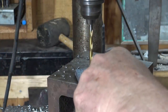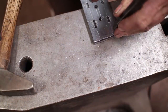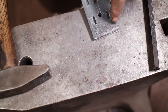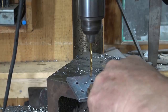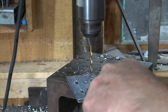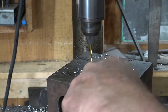I'm going to drill both plates together so that my slot ends up in the same place. While I'm drilling these, I'm going to drill for the corner screws. These need to line up as well, because I'm going to thread one plate and screw through from the backside all the way through into the other plate. With that in mind, I'm drilling with a number 25 drill bit, which is the proper size for the tap on a number 10 machine screw. I will then drill out the inner hole to allow a clearance hole for that, but on this side with the bolt that it's going to get threaded, this is the proper drill size.